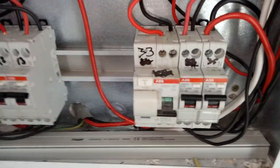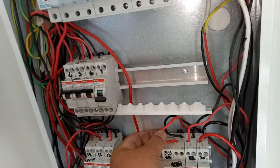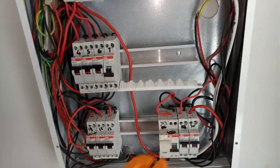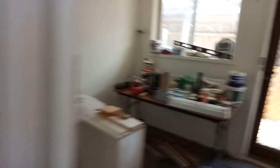Before you work on one of these things, I recommend you go to your switchboard and find out which circuit breaker or fuse runs the evaporative and switch it off down below. This switchboard's open because I wanted to current monitor it below, and because it was raining I couldn't do it from above, so I used a clamp meter to measure it. Always switch it off before you work on the unit, otherwise you might be in trouble. These units are up on the roof, so we're going to go up on the ladder and I'll show you what we're dealing with.